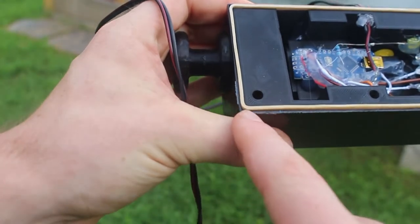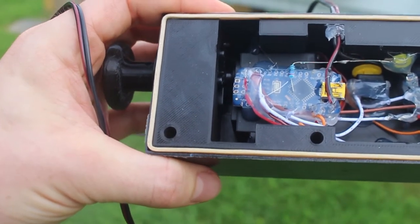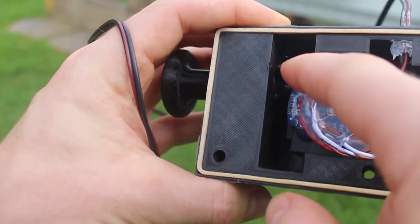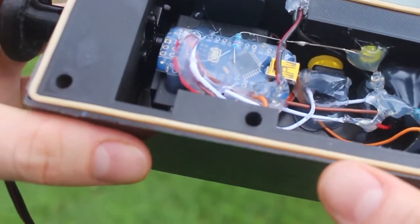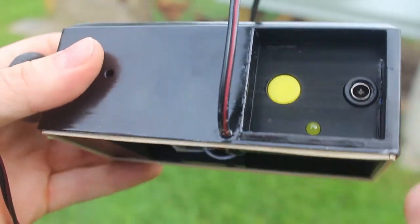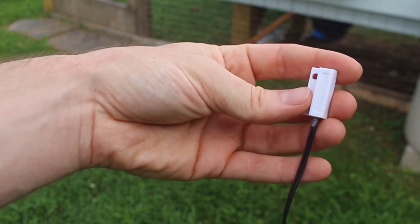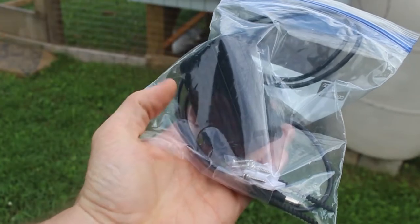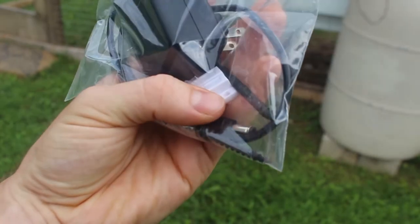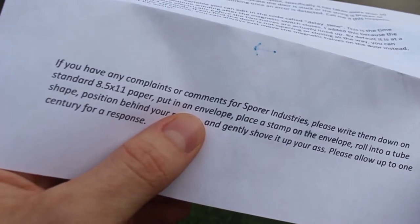Outside of the 3D printed box, looks like he used a little rubber band here for kind of a waterproof gasket when I mount it above the door. Here is an Arduino Nano — it's the smallest kind of Arduino you can buy. It takes solder connections only, and it looks like he's potted it in hot glue to keep any corrosion off the board and make sure everything's functioning correctly. Underneath it is the servo motor — that's what's doing all the work. We have a button here, which I suppose is going to be to raise and lower, and an LED which I guess is going to indicate status. There's a power connection, and this wire goes to a magnetic switch — this is going to be the feedback for the door so that the Arduino knows what position the door is in. He also supplied a 6-volt power supply with the mating parts for the magnetic sensor and a couple more screws to install it. And then, of course, these instructions, which may or may not be laced with some profanity, and probably one of the better return policies I've ever seen.